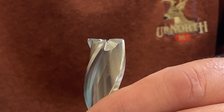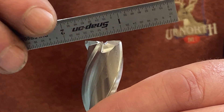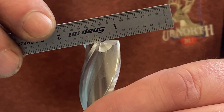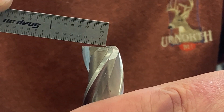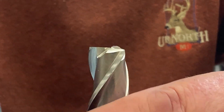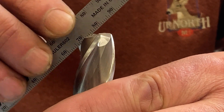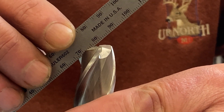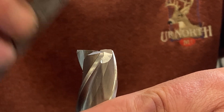Some pretty typical features and angles on the end of an end mill are the relief angle of seven and a half degrees, a clearance angle of generally three degrees in this direction, and then the actual angle of the gash itself isn't so much written in stone — that's kind of more of a by-feel kind of thing.